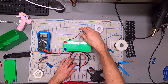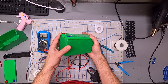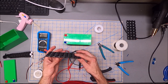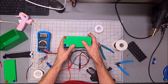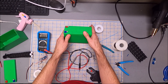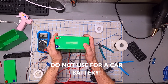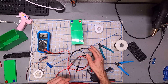You really shouldn't run lithium batteries without a BMS. But if you want to build yourself a nice self-contained 12-volt battery, I like these cases and I like the holders — they're good. There's enough space to do some soldering. Just remember this is not going to be super high powered; 10 to 20 amps is probably the max you should pull. But it's a nice form factor that turns your lithiums into a portable unit you can take for whatever project you need.